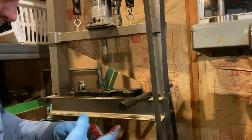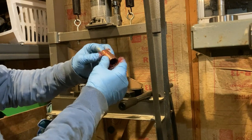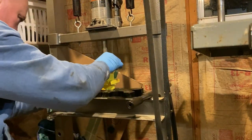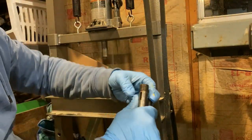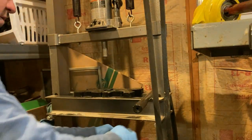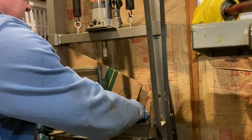I'm just greasing the items here to make sure they're good to go. That again is the spacer - the spacer on the bigger mandrel is bigger than the average size one. As I'm pressing this one down - this is the second bearing going into the mandrel - I'm pressing it down not all the way tight because I want to make sure I have some leeway to line up the shaft going through the spacer. Remember that each bearing is solid up against the walls of the mandrel, but the spacer kind of floats in the middle.